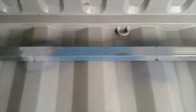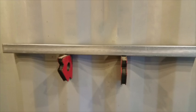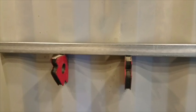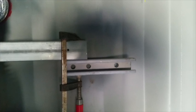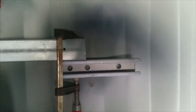The first rails I welded were the 50cm supports for the lights. I mark out the lines, and then I use the flapper disc to remove the paint where I'm going to weld. I only need to do the bottom part. I use welder's magnets to hold short runs in place for welding. And I use clamps and a piece of scrap metal to make a shelf that holds in the longer ones.